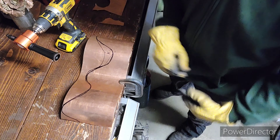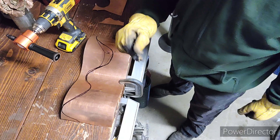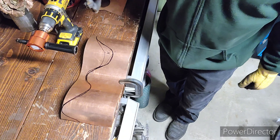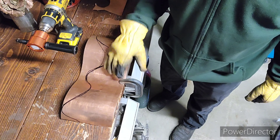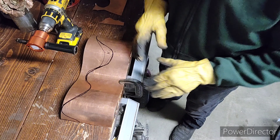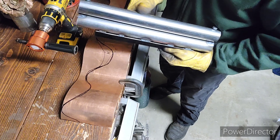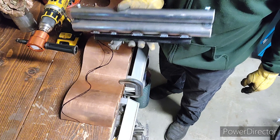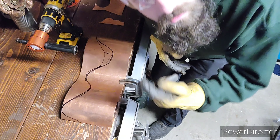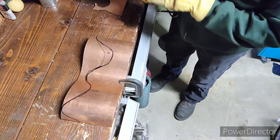Alright, we've got everything set up and ready to go. I do have this piece of artwork flipped over — this is the back side — because this seems to leave tooling marks on the top of your cut and I don't want to see those. One disadvantage I've seen to this tool is that it does require a substantial amount of force to push it along, so you absolutely need to have your part clamped down. For copper, for example, this is already formed and I have to clamp this down — I don't want to put a bend mark in it. Safety glasses and gloves.